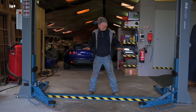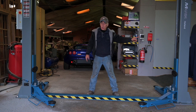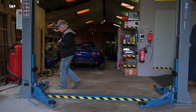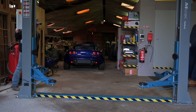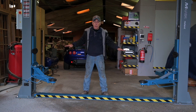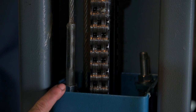Push the button up and the lift will go upwards. Keep an eye on the piston on the other side and listen to the clicks — the locking clicks should happen exactly at the same time. If not, we need to adjust. One column clicked a fraction of a second earlier than the other, which means both shuttles are not on the same height, so I will have to adjust the cables — not about tension right now, but about leveling out the shuttles.